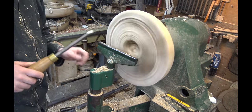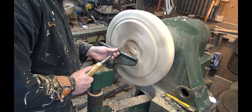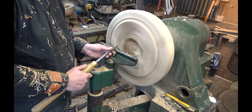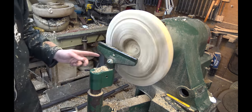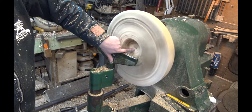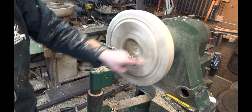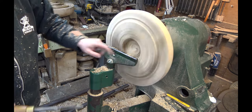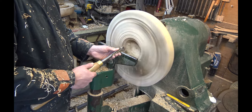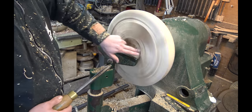This is a great opportunity to practice every single cut and make each cut the best you can — that really helps when you come to your finishing cuts. Another reason people get catches is feed speed: they try to move the tool at the same speed throughout. Imagine the bowl like a running track — the center is spinning a lot slower than the outside. Just like an athlete on the inside lane has an easier time than one on the outside, as you feed the gouge in toward the center you want to slow your feed rate slightly. That gets you a nice continuous smooth cut across the entire piece.